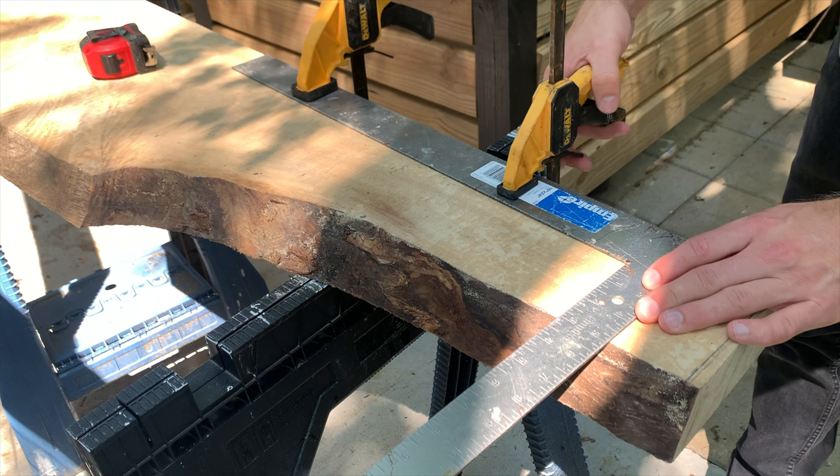At this point we're going to take a router with an eighth-inch round-over bit and go from this really crisp, hard line — which would destroy your knee if you hit it — into a rounded-over edge, then sand it smooth later. Giving your table a rounded edge is optional but I think it's definitely worth it. Building these tables requires a lot of tools and a lot of time, so unless you're an avid DIYer who really loves the look, it might just be better to buy one. All the tools and materials I used will be linked in the description.